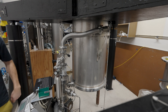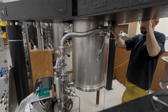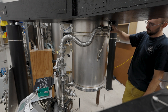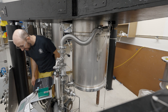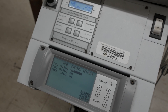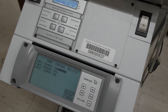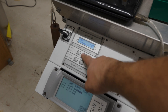Ready to do the honors? Go for it — first pump-down in six or seven years. Going to open up the valve. All right, we're pumping down. Three hundred and ten torr at the moment. We'll get down below about 10 torr and then we'll turn on the turbo pump and let it pump all night. All right, after like six years, turning on the turbo pump.